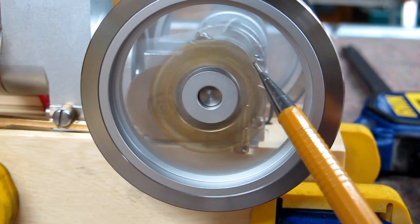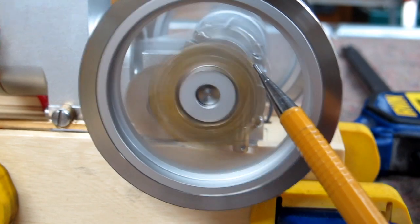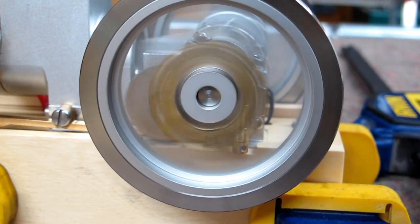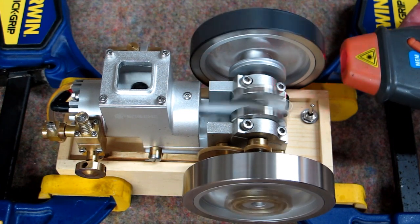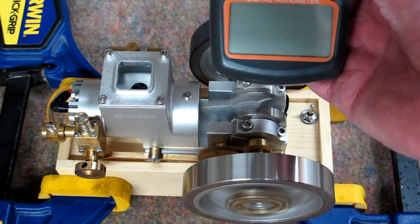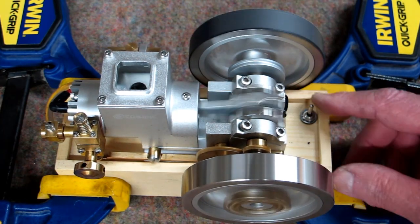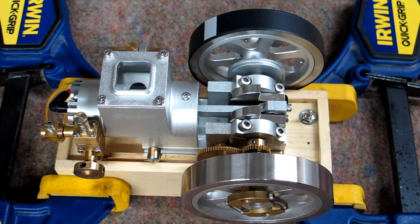You can see the weights are going out further and they're staying out longer than they were before. We're below 1200 RPM, so that's slowed this down quite a bit and it sounds a lot more like a hit and miss engine. I would assume if I stretch those springs a little more, I could get down to about 1000 RPM.